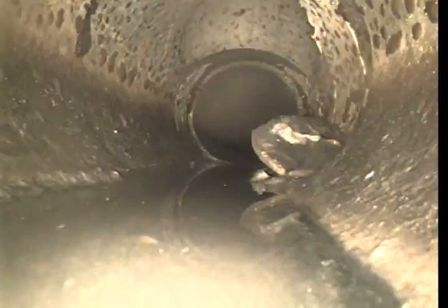There's our problem right there — it's got a broken pipe coming in on the right. You can see it right there. It's a broken section of pipe right at about 38 feet. That was our problem area, coming downstream.